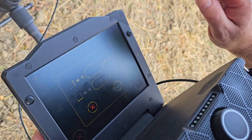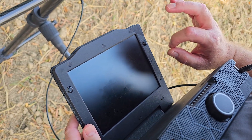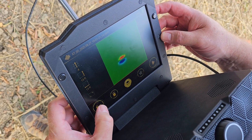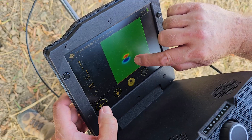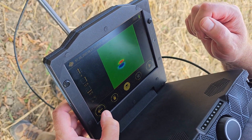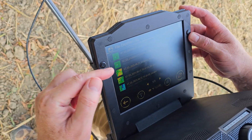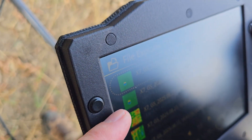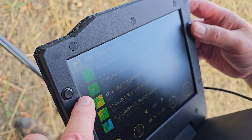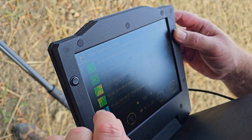Prior to saving, we save it and put our dimensions in — 13 by 13 — and we have basically the same hit as last time. The target hasn't moved and it's the same strength. We've got a nice blue signature next to a nice red signature. That tells me whatever is in that area is magnetic — it's ferrous metal. In the file explorer, you can see thumbnail shots of all your scans, and these two scans are nearly identical. When you have something like that, you know there is a target in the ground at that spot of your scan field.